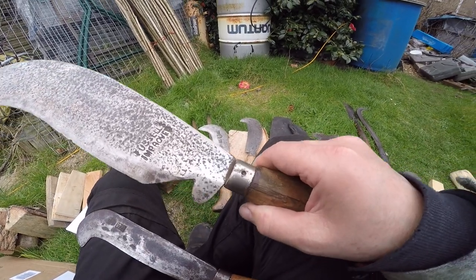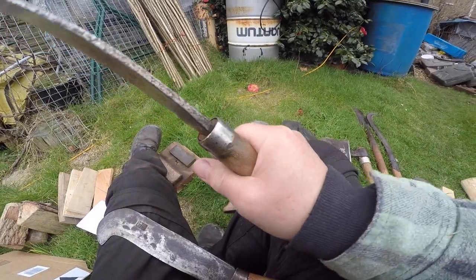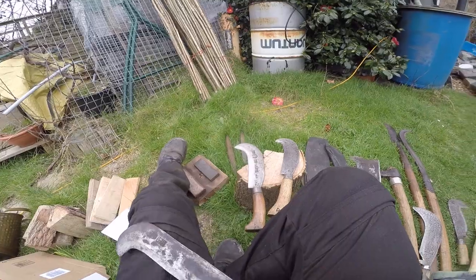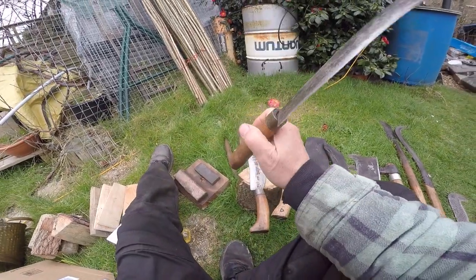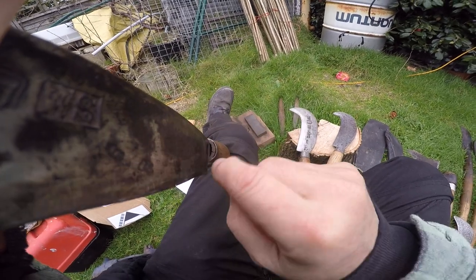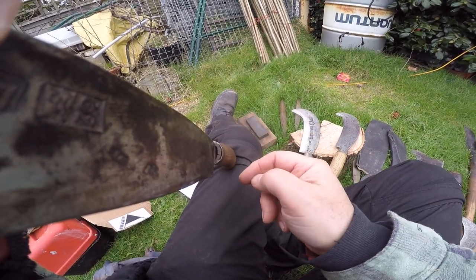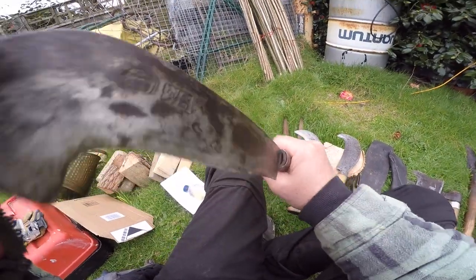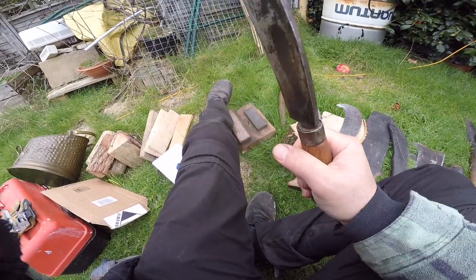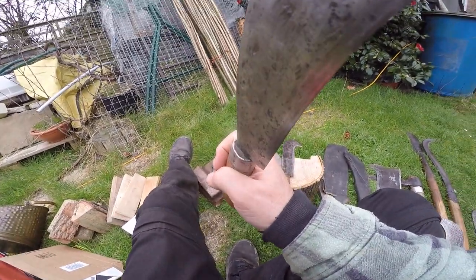Avoid half tang — it's usually the mark of a cheaper hook, unless it's been made by a blacksmith who really knows what he's doing. Modern ones tend to come with a pilot hole all the way through, and that tends to be larger than the thickness of your tang. So especially if you're cleaving with it, it's going to work loose. It needs to be fitted properly.